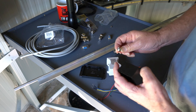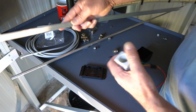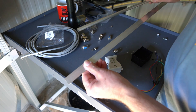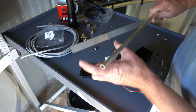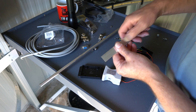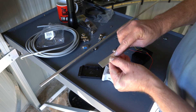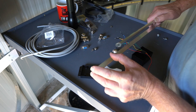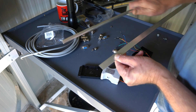These sensors are also 12 volts, which makes it ideal — I can power them from my Pegasus Astro power box. For mounting, I've got two bits of aluminium: one flat piece that mounts with this rod. I'm hoping to drill a few holes in here and bend it so the rod can go between the two pieces and slide up and down, staying in place. At the other end on my telescope I'll do something similar — a large hole in each end going up like a V so the rod sits in it. As I push them together and slide this in, it'll stay, so I'll be able to adjust it telescopically.